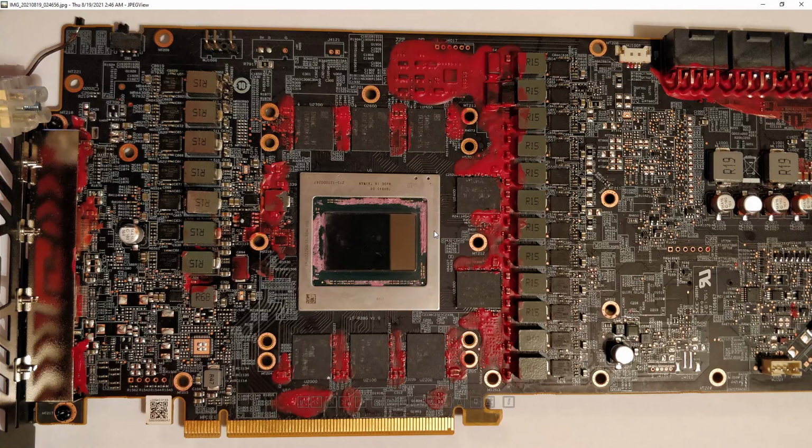Where was I going with this? Yeah, so basically, if it weren't for the fact that I have a lot of GPUs, it would have been a good idea to run this card for a month, to actually get a month of runtime on it. Not even stressed runtime, just idle, load, just using the card for a month, to ensure that it's in actual good functional condition, because you do occasionally get dodgy components that just sneak out of the factory and then die within a month.